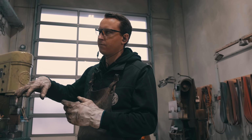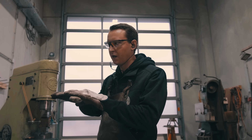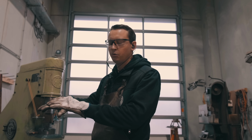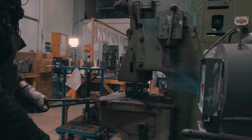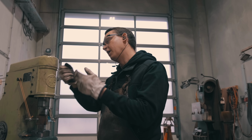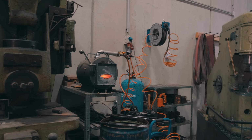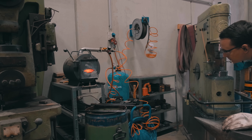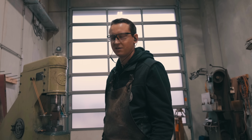Usually I'm forging knife after knife with an overlap of 2 knives. So I'm putting 2 sheets in at a lower temperature, and then I'm forging one, putting it back in. For example, the tang, forge out the tang, putting it back in to heat up, and then I take the next piece, forge the tang, and so it cycles always. When I'm done with one piece, I'll get the next in, and so it's always 2 pieces in the forge.